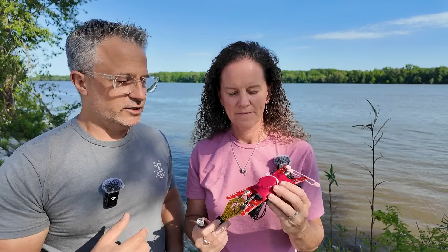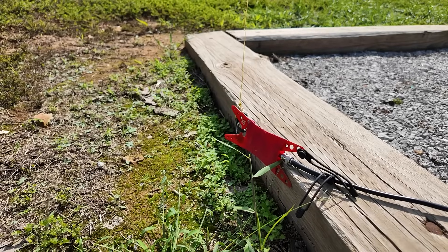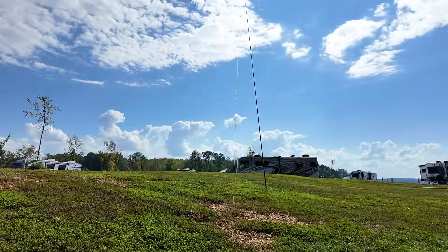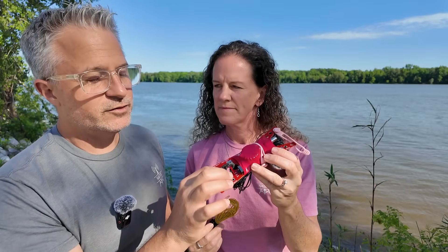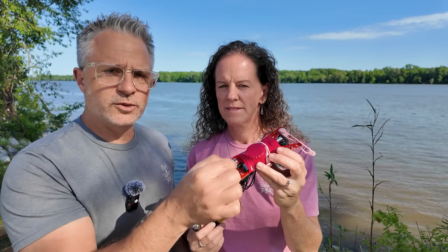So let's talk about these particular ones in general. This one's from Extenna. It's a great one because it comes pre-built — you don't have to do any soldering, you just have to cut the wire. It comes with a switch to be able to switch between 49-to-1, 56-to-1, and 64-to-1. If you don't know what all that means, you basically just switch this toggle switch after you get set up and see whichever one gives you a little bit of an edge in terms of the match — meaning the SWR.